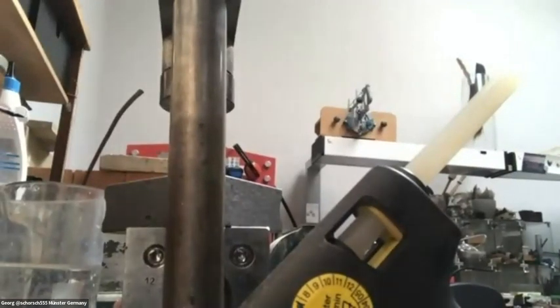It's even a good thing when the hole is bigger, because you can even out some unequal placement. So if the blade is a little bit to the left, to the right, or whatever, you can just drill the hole half a millimeter or a millimeter bigger if you have the space in the handle, and even that out with the glue as well, and make up for it if you messed something up before. So yeah, done with that.